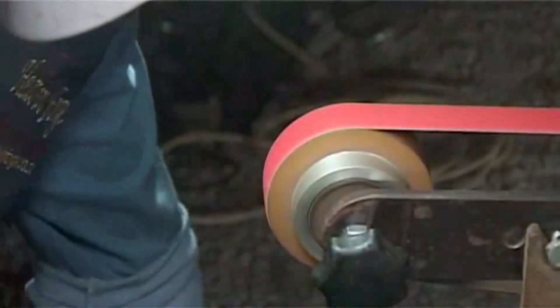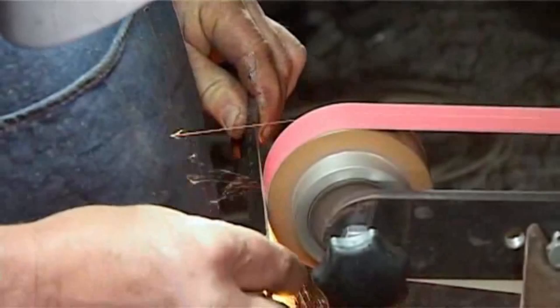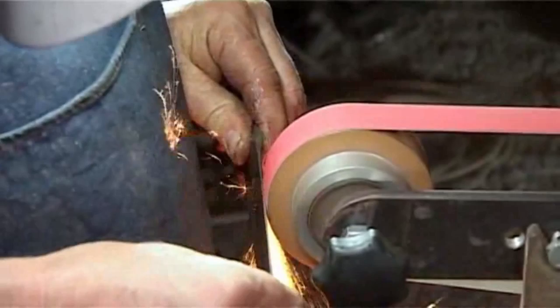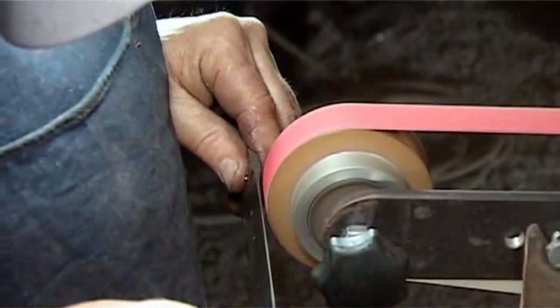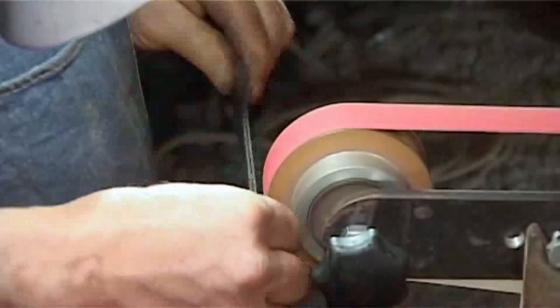Often people are pedantic about putting their blades in water before heat treat. It is a concern. You don't want to burn it blue. It does create unequal stresses that may come out in the heat treat. But burning your steel or overheating your steel before heat treat changes nothing in the steel itself other than a few stresses. And if you're leaving your blade oversized anyway, which you should be doing, I've never really had big drama because of it.